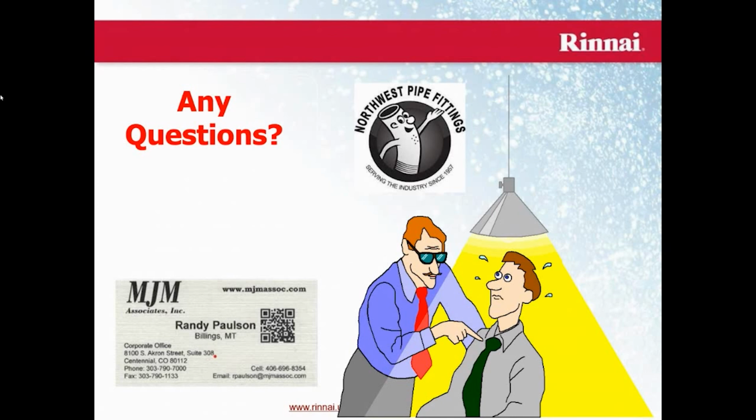Yeah, we're really happy with this. We just did a little project here in town, they had 32 of them go in and not one hiccup. So, this one here came back, kept burning transformers out, and finally when I went out to the job site, sure enough, there's a guy with a zone valve and a thermostat hanging on the wall, wired to that 24 volts. Popped it every time.